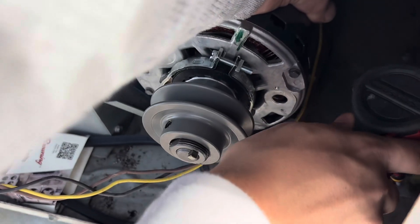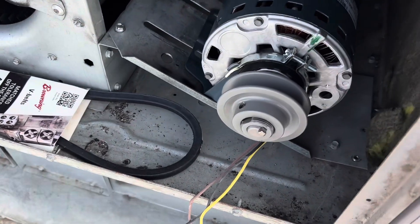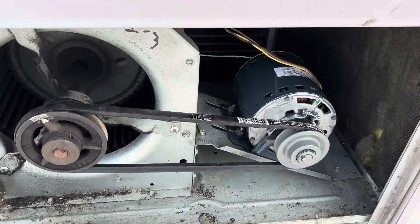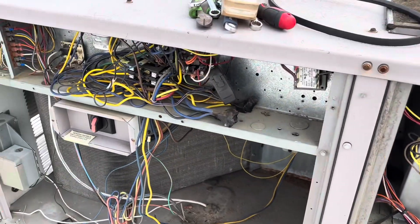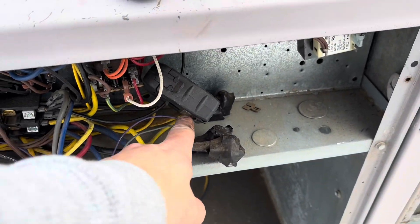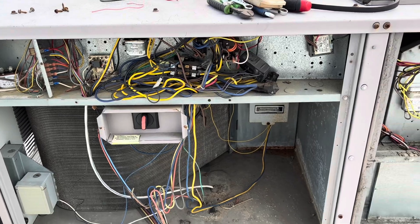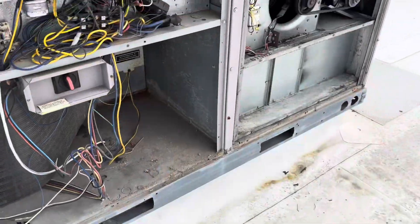Kenny's gonna lock those screws down; we can slide this up some. We're still loose on here so we'll get our belt — this belt honestly looks new, so we're gonna put this on. We got our new capacitor in, new motor in, new belt. We rewired our L1 wire through the current sensor. I think we're good — we're gonna find out if they messed with anything else. We're about to restore power and see what happens. Here we go, moment of truth.